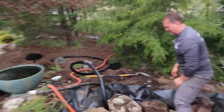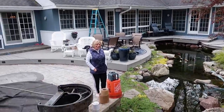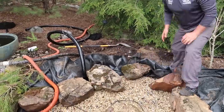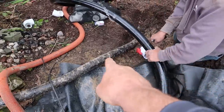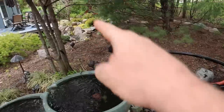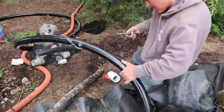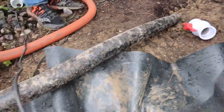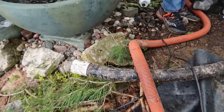Ask Pond Mom what she thinks. She says, 'I thought it's looking strange - I'm fascinated by it.' Now we are just gonna take the new pipe, hook it up to the old pipe, and put a ball valve in there because this pump actually feeds the spillway over there. Then use some primer and some PVC glue and hook it up to the old pump that used to be hooked up to the Bio Falls.